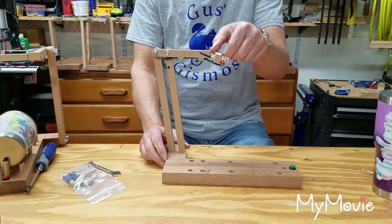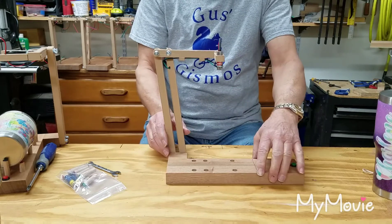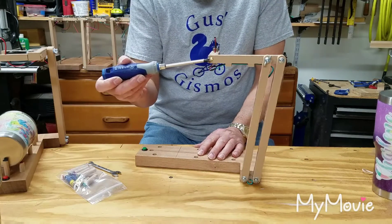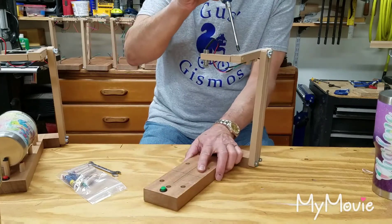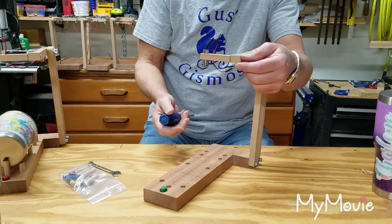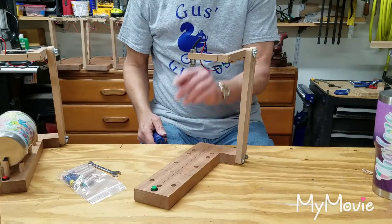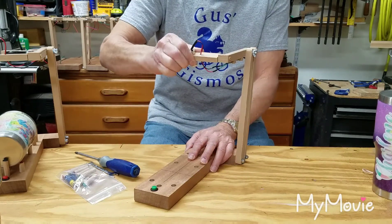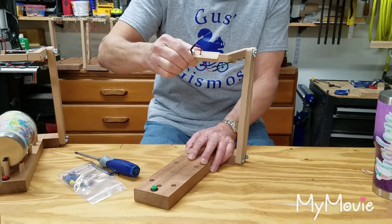You'll notice that your laser itself is out of position, so we're going to aim it straight down. I want to point out that we have a brass screw here — this screw is meant only to hold the arm in place, otherwise the arm would work its way out. If you over-tighten it, it's going to strip the plastic inside. Make it friction tight so you can let go and it won't flop around.